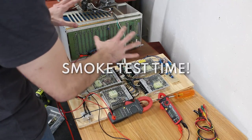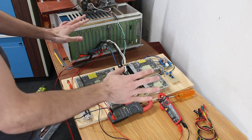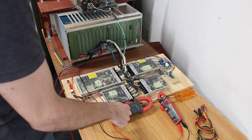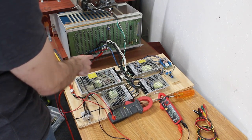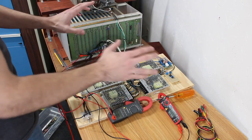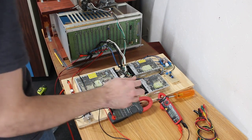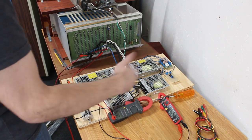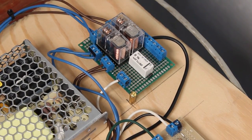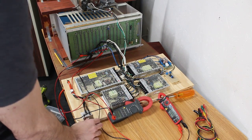I think I've got everything wired up correctly — I genuinely haven't tried flipping the power on yet, so I have no idea what's going to happen. I've got two multimeters hooked up: one on the 5-volt rail, the other on the negative 12-volt rail. I want to make sure the voltage levels are accurate and that they both move at the same time. If the negative 12-volt rail moves before the 5-volt rail, that means my relay circuit is not working correctly. I hope it doesn't go up in smoke — here goes nothing.